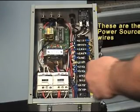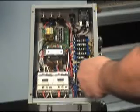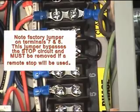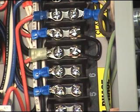Next, install the power source wires and attach them to terminals number 1 and 2 and the ground lug in the control box. Verify the limit switch wires are connected correctly. Note that there is a factory installed jumper across terminals 7 and 8 — this is the remote stop bypass. This jumper must be removed when the remote controls are wired to the machine.